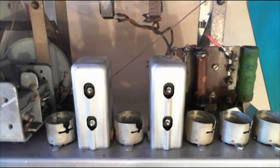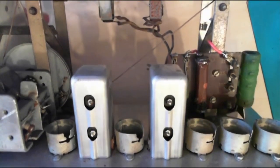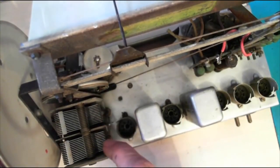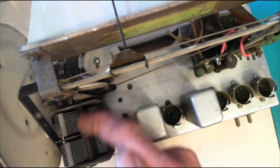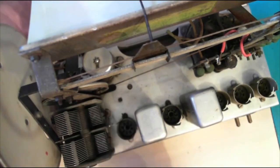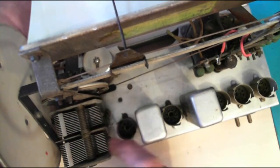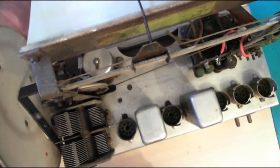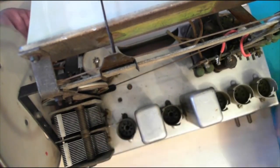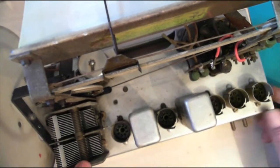This is where we're looking around a chassis. Okay, this is the Bush DAC-90A radio chassis. Now you'll remember in the video about reading circuit diagrams, I mentioned various bits and pieces, such as the variable tuning capacitor. This is two variable capacitors on one shaft. When you turn that, these aluminium vanes mesh with the static vanes here, or unmesh, so that increases or decreases the capacity. And you've got oscillator and aerial sections on there.